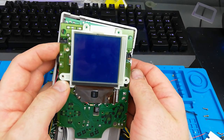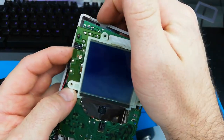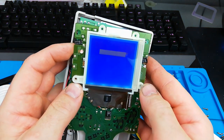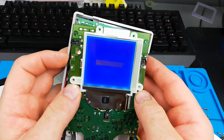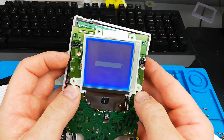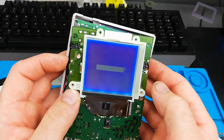I've just loosely set everything back in for now — moment of truth, we'll turn on the power. Boom! That looks like it's working beautifully. You will notice that for now the colors are inverted to what they usually are, so that's the next step — adding that bivert chip. That'll sort everything out and give us some beautiful dark contrast.